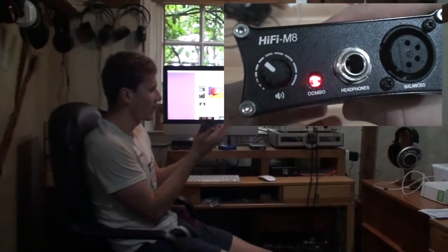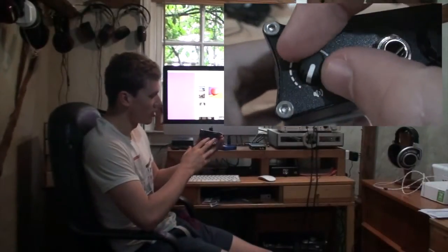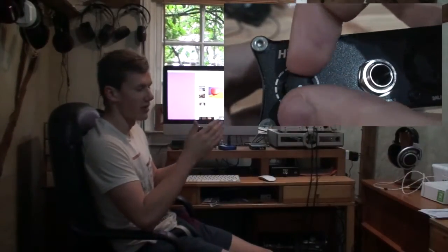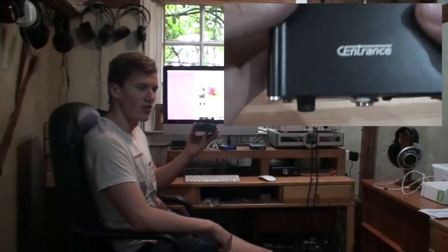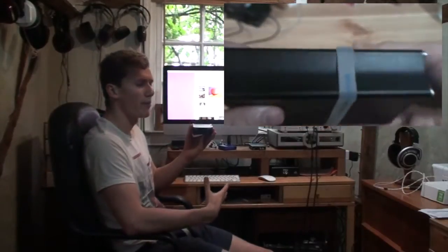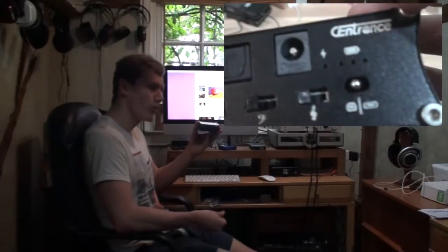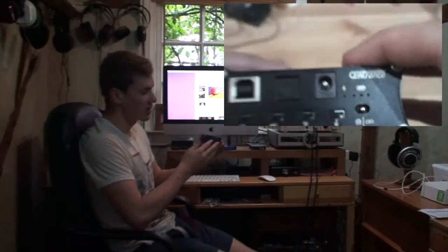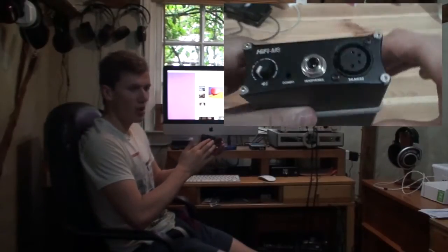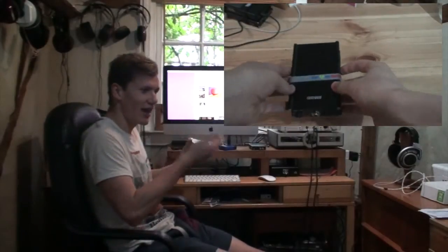There are also three gain settings — high, medium, and low. With low-impedance earphones I put it on low gain for nice volume control, and high gain can drive anything. Then there's a treble and bass switch with three settings each — it's a really subtle movement in the frequency region, but you can notice it without it being overdone, even on the double-plus settings. You don't want overblown bass the moment you touch the switch — just a little warmth added. So you can actually colour the sound: full bass plus plus, treble plus plus, 11-ohm output impedance — or go the other way. There's so much variation of what you can do.